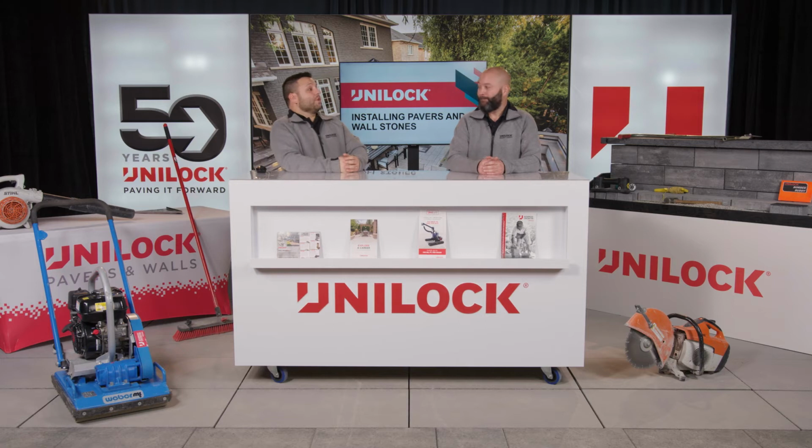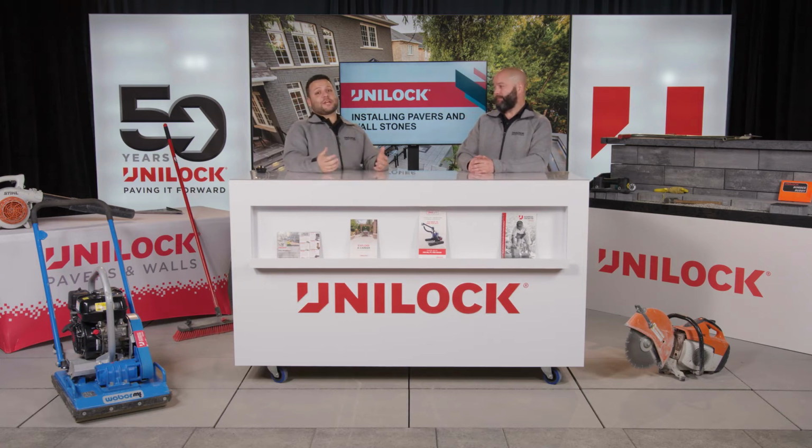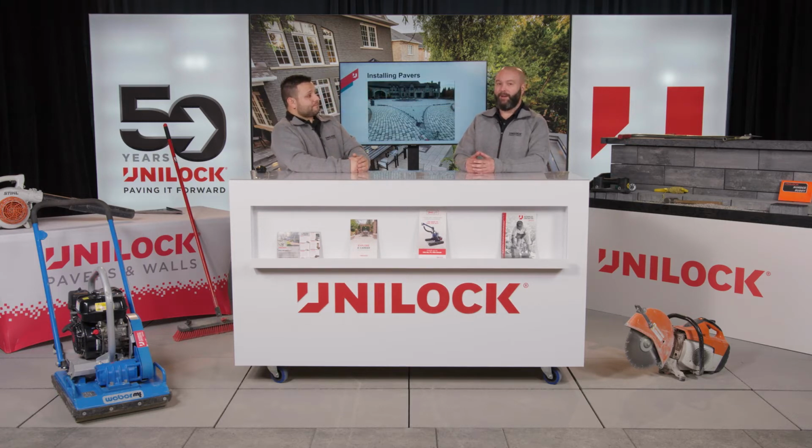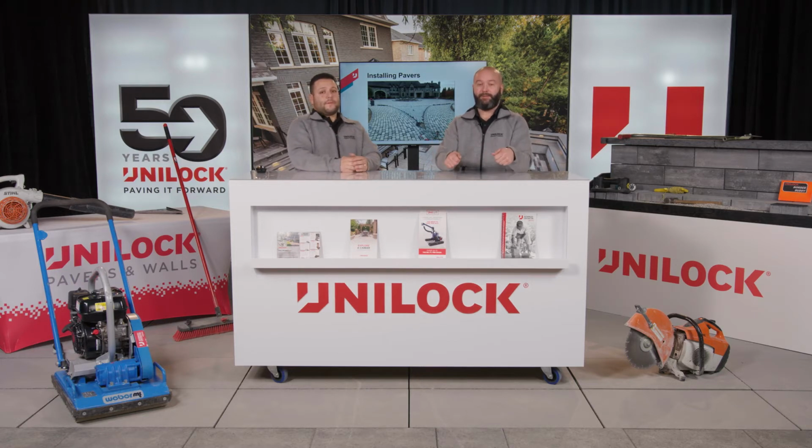Well, there's quite a few really helpful tools and innovations in this section of a job site, and we're now finally ready to start installing and cutting our pavers. The basic installation is using your hands with the click and drop method, pulling the paver against the field that you've laid already and then dropping it in place. You don't want to pinch the bedding layer between the two pavers because that's going to throw your spacing off.